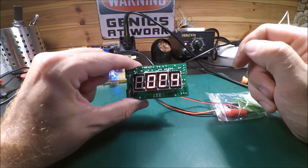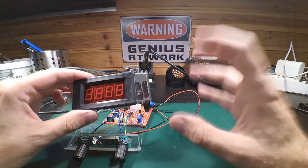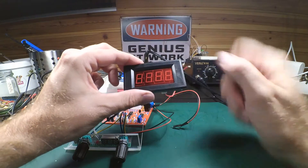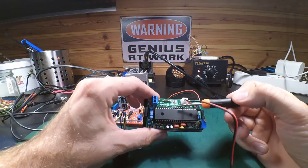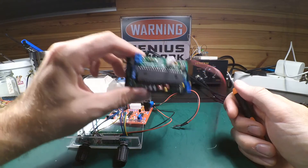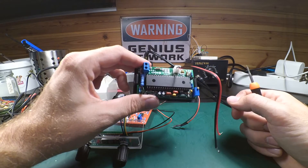Now I have to troubleshoot the segment, connect it up to my other power supply, and connect everything together. Time to put it together - the display is all fixed up. It was a bad solder joint which is why I didn't have all the segments working. I did a lazy solution - I just took a bit of wire and ran it from the output leg down to the pin of the segment display, so I got everything working. Sometimes you do the lazy solution rather than desoldering everything.